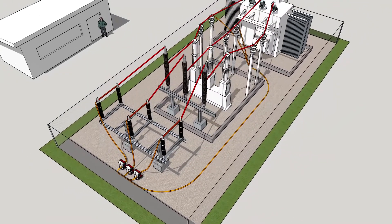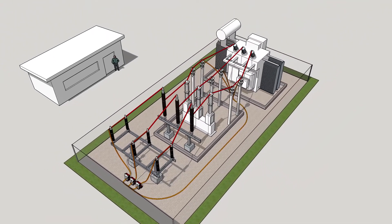One of the most critical tasks in substation commissioning is checking all circuits, protection devices, and control elements for proper interconnection. The most efficient method to achieve this consists of examining measurement values displayed by digital protection relays while primary current of a known value is injected across the entire circuit.